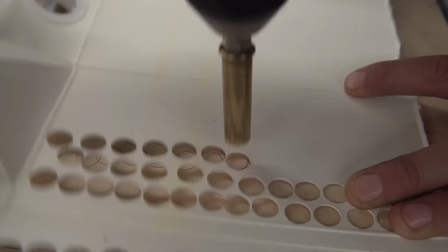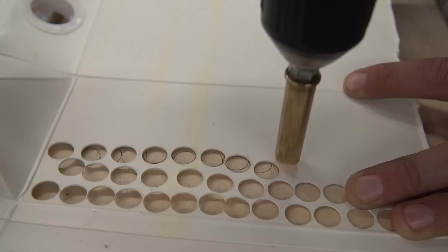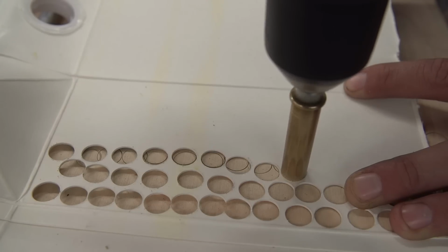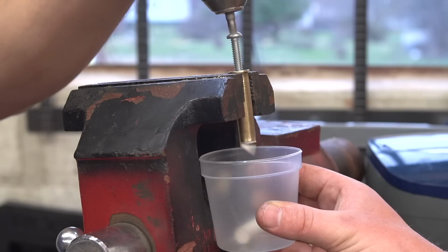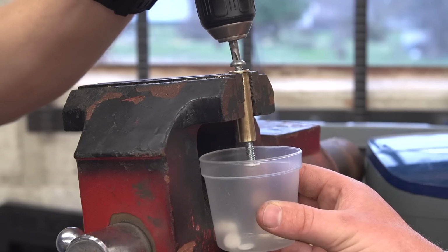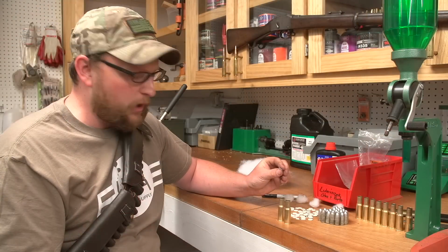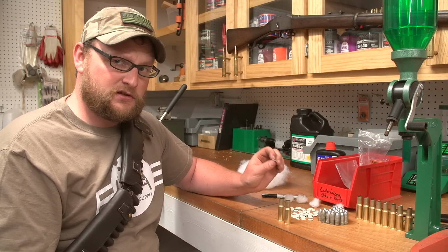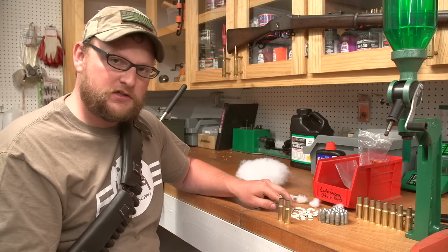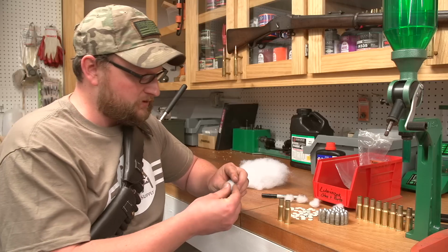And then he hooked it up to a drill motor, and he can spin it and cut these discs after chamfering and deburring and sharpening up that 4570 case, and it allows us to cut our perfectly formed discs. Now, these are just cut out of a little juice carton. It's kind of a cardboard substance with a waxy impregnated coating in it, and they're 30 thousandths of an inch thick. We're going to need 2 of these per cartridge, and we're going to need our tuft of wax, which we'll move to in a moment.